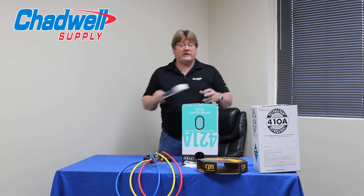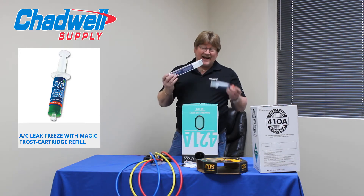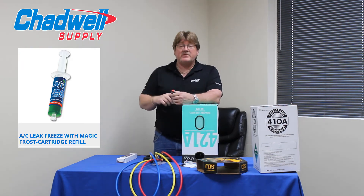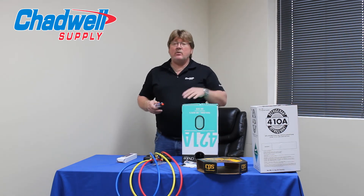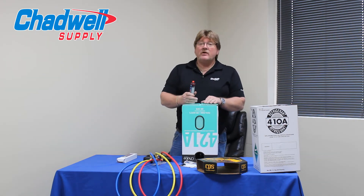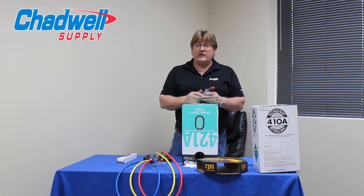There are many tools out there to help with leaks. There's one called AC Leak Freeze with Magic Frost — the product is good and does work in certain applications, but what I really like is the tool it comes with. After you've used it, save the syringe: when you buy a jug or can of POE oil to add during any of the retrofits, you can pull the POE oil up into the syringe, measure it, put four ounces in, and inject it into the system for oil return. For the most part most systems will work fine, but after monitoring you may find certain situations where you have oil flooding in the evaporator, and the addition of POE oil will help with that return.